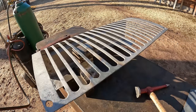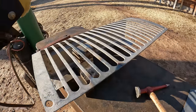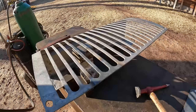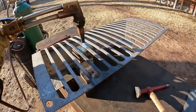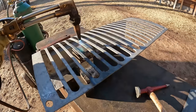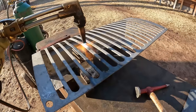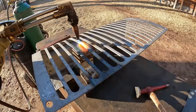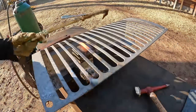What I'll do is heat it red hot and then hammer to either side of it, and what that does is just kind of compress all of the metal molecules back a little bit. It's not uncommon to see these really start to move and spring up, because when the steel gets red and starts to get elastic, all the stress and push goes to that one spot. I just want to get it thoroughly heated right through the problem area, with my dolly in place behind it, because this is very much a strike-while-the-iron-is-hot scenario.